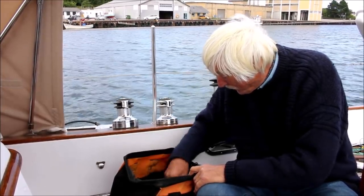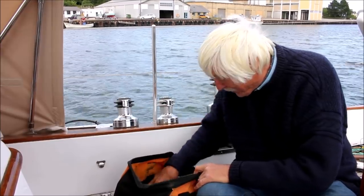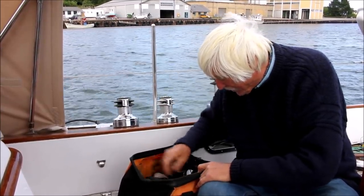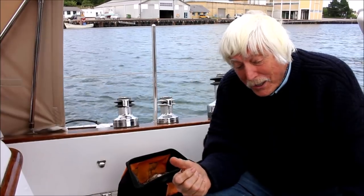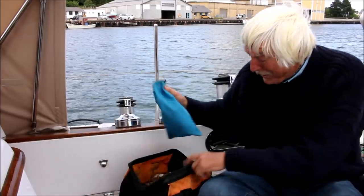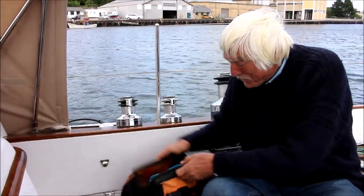That's a useful rigging bag. There's something else in here I can't find right now — I've got a complete set of splicing fids for splicing modern rope, for splicing braid line. And only two days ago I put a Brummel splice into a Dyneema halyard for my new Code Zero. So the old rigging bag's not dead yet. We're still using it. Rigging goes on.